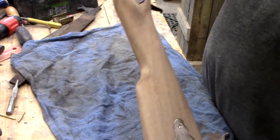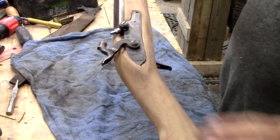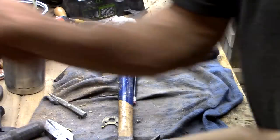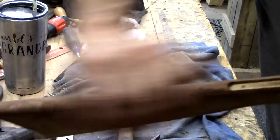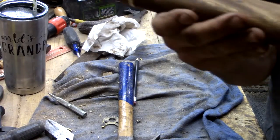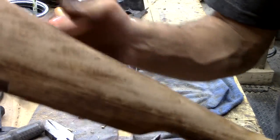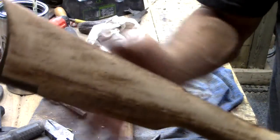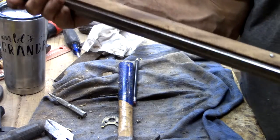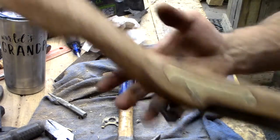This is a dried finish and I'm going to take some 3,000 grit sandpaper to knock down the grain, and then we'll be moving on to the tung oil. We've got the walnut stain on now - kind of cobweb looking. What I like about this stain is it's water based and it'll go in there, lift up the grain, and really get in there. As this thing dries, here's a good example - it looks like nothing's on there at all until you put the tung oil in, then it brings that right back out. This is one of the finishes I've used in the past and it's worked really well for me, so I continue to use it. I'm just going to let this dry and then we'll be moving on to the tung oil.